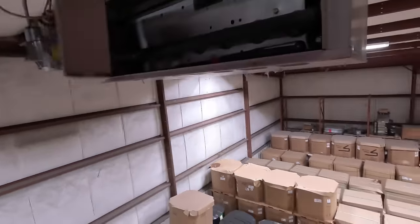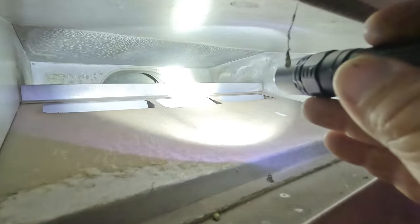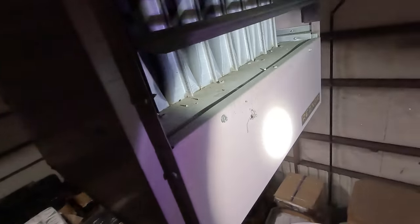Look at that - nice clean pilot, looks like it's staying lit. Let me check the heat exchanger real quick to make sure that's all right. I don't see anything up on top. We're going to check this heat exchanger here to make sure we don't have any cracks down the center - usually that's where they crack at, horizontal. The cracks for the most part aren't going to cause a CO issue in a building like this, but it could cause a possible fire issue, and that's not something we want. Going across the top and back sides - that's probably fine.